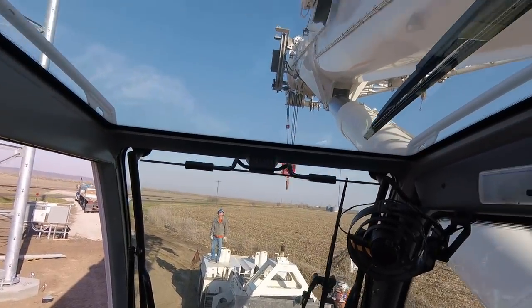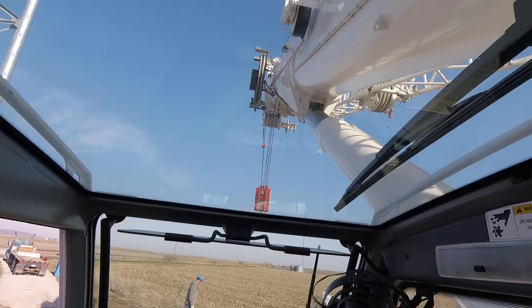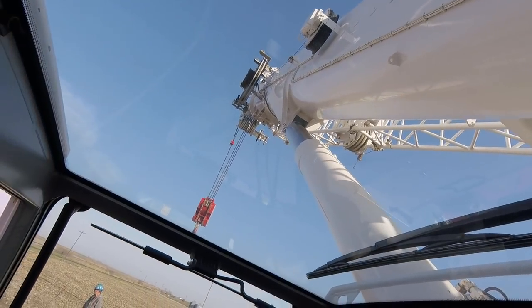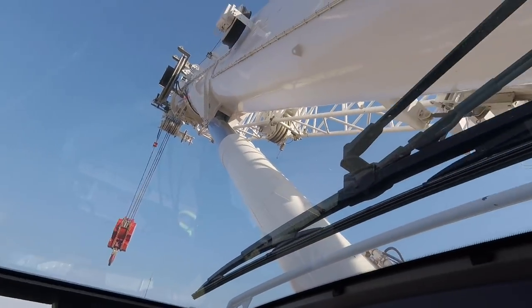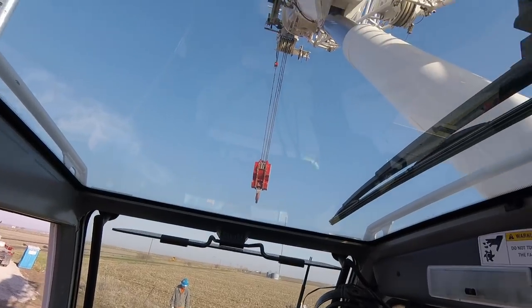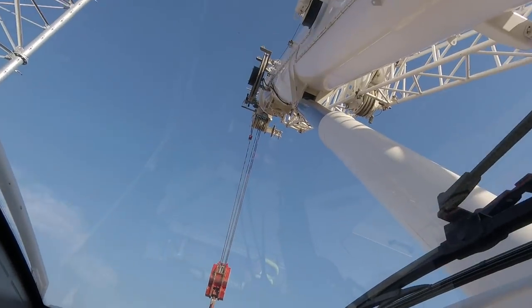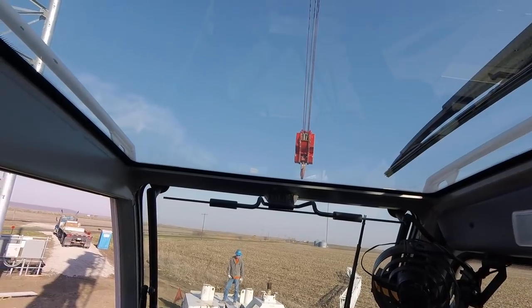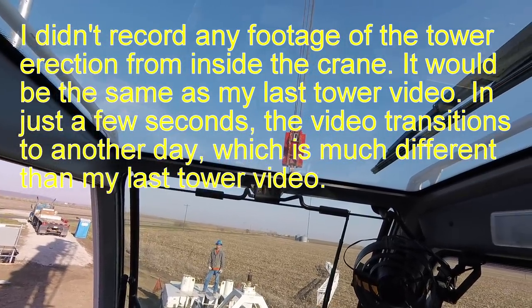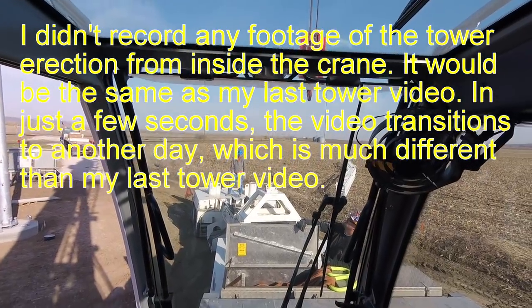So what that entails is the swing away 43 foot piece that you can probably see a little bit of there on the right side of the boom. We have to swing that out and pin it on the end of the boom, and then it actually splits in half where those pins are right in front of those sheaves. When I say half, it's not quite half, but it leaves a 17.8 foot section on the end of the boom, and then you take the point off, and then we stick all those pieces of jib together and put the point on the end of those, so that gives us 123 feet of jib. And then when we run out 197 feet of main, it gives us a boom length of 320 feet and turns this thing into a fly rod. Which is always fun.